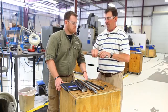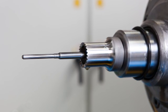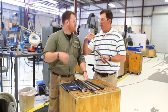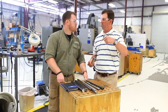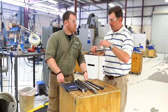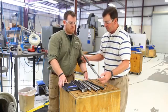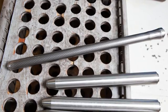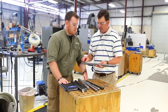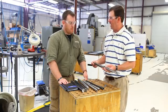At that point, these are loaded in. The arm comes down, picks it up, loads it into the hammer forge. A mandrel is inserted and the hammers converge on that barrel. That mandrel has the chamber as well as the lands and grooves for the rifling. Those hammers follow that mandrel down the whole while that's turning inside. It comes out the other end as a blank. Each one of those little striations you see there is a different hammer strike. It's about a six-minute process from this to this in the hammer forge.